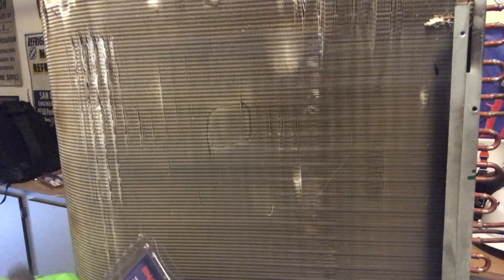Today we're going to be talking about leak repair on a condenser coil. Over the years, guys have driven screws into coils — if they've slipped with a screwdriver and it punctures the tube on the inside. Sometimes it's just a very small hairline fracture, or maybe the copper is starting to break down.